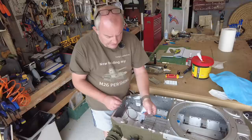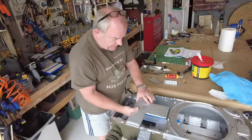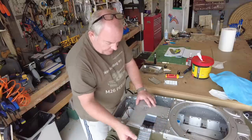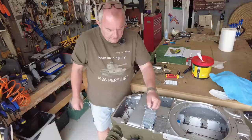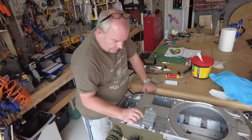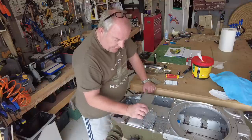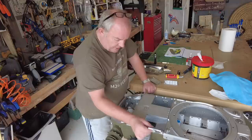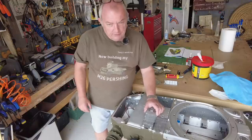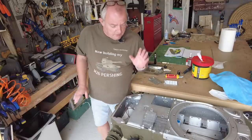The other problem is, if we put these just back there for now, just put this T plate in position, just loosely. This sits on there nice, that's fine, but look at that. It's not going to shut because the screws are fighting each other. So I'm definitely going to have to grind this down on my bench grinder. And also the screws on the back here are pushing or fighting against the hinge. So this is just in there very loosely, and that allows me to do that, no problem. So I'm going to have to do some work on these. So I'm going to start using my bench grinder. Ben will probably speed this up because you don't want to hear that noise. But I'm fortunate I have got a bench grinder, and I'm hoping that that's going to do the job.